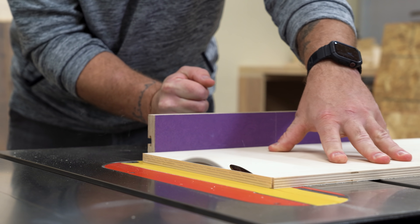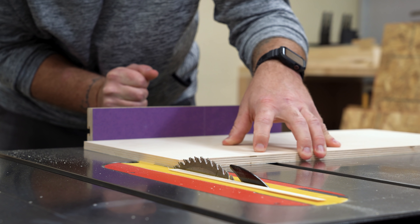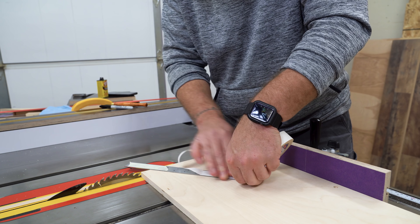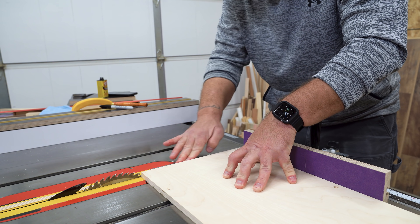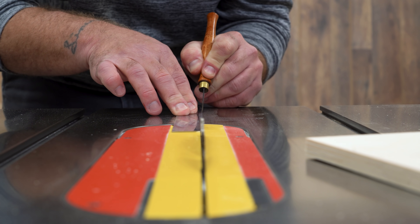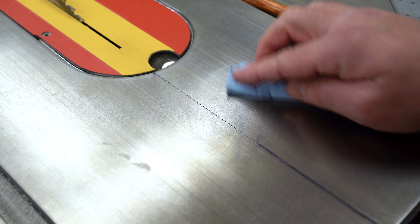I cut a fairly wide piece of plywood at 90 degrees, turned the saw off, and then slid the whole thing back to register where the leftmost side of the blade was — which was also a viewer's suggestion. While holding that piece perfectly in place, I secured a steel rule to the table right up against the plywood with double-sided tape. Then using a marking knife, I carefully started scribing the line right up against the rule. Once I had the line scribed, I removed the rule, used a Sharpie to make the line just a little darker, and then got rid of the excess marker with some adhesive remover.